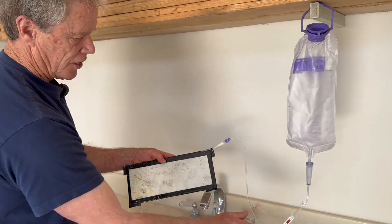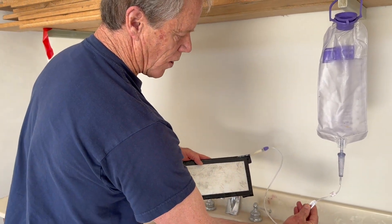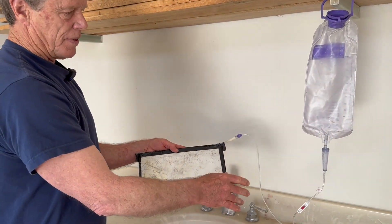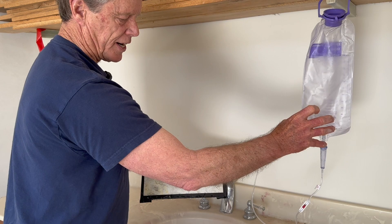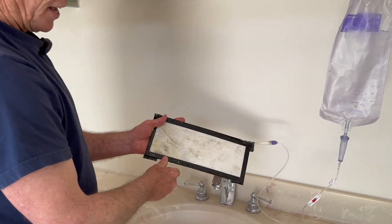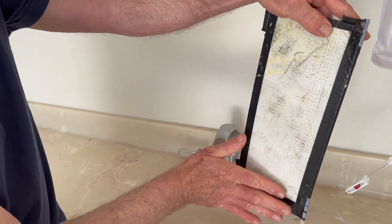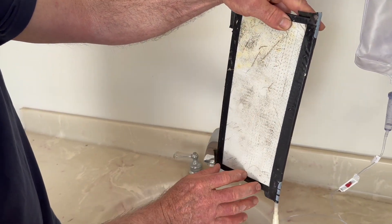This is another version of the lubricated form surface. We have a controlled flow of water — it's out of water now, but this is a really simple, cheap way to control some water to test these. This is a porous material — you can see it dripping — and if you put concrete on here it will just slip right off.